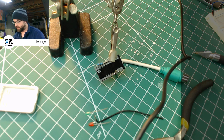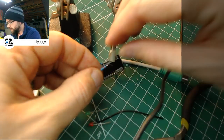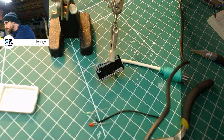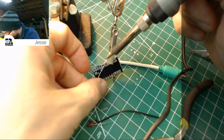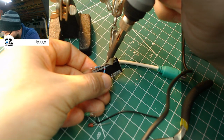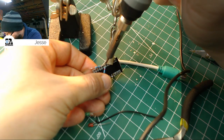That one crosses to the other side. So we're going to run that towards the middle more. And then once it's in, we'll fold it over. Hit that with a little paste. That's what I should have done with the last one. So we don't want them to touch, so we're going to bring it to the middle. There was almost enough solder on there to finish that, but of course not quite enough.